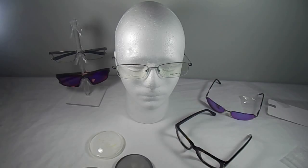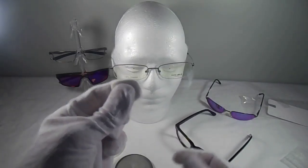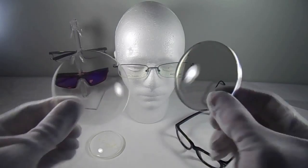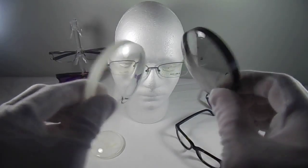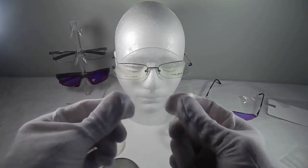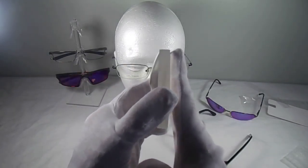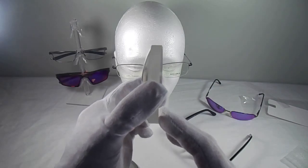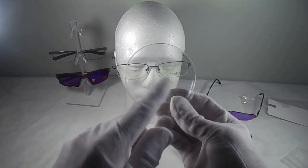Let's start out with what the actual process of a digital free-form lens is. True free-form digital lenses always start out — here's a clear lens in my left hand and an extra-active lens in the right. These are what they call the free-form pucks. They're basically single vision blanks. When processing a true free-form design, everything is on the backside: your distance is ground in along with the intermediate and reading zone, whereas standard and advanced designs have that molded into the front.